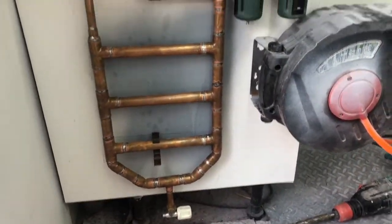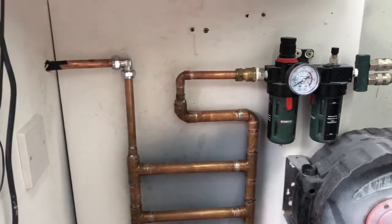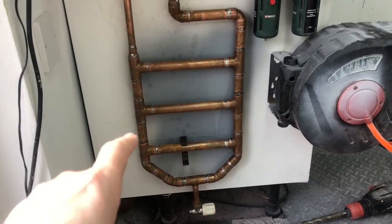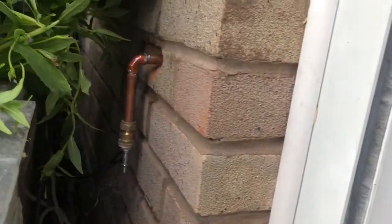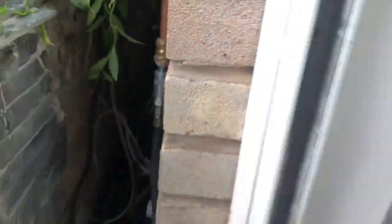The compressor is all charged up now. As you can see it's all soldered up, as you will have seen hopefully in a time lapse. The idea is air comes in, shoots down, there's a trap down the bottom and a valve, and I'm hoping that just the air finds its way up. On the outside I need to connect the airline in and then click to release.